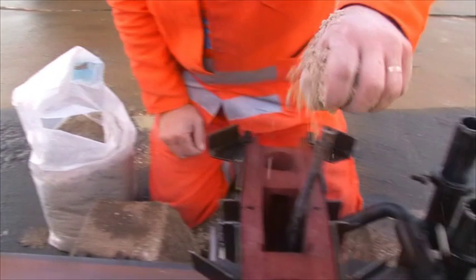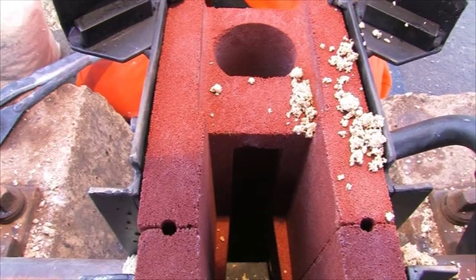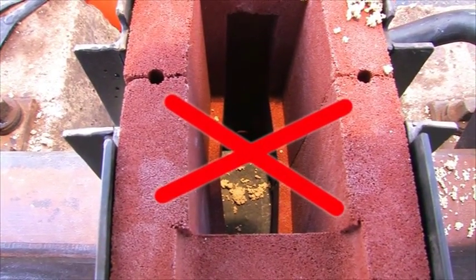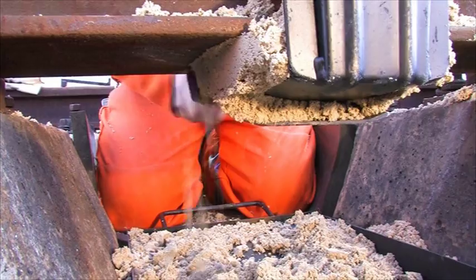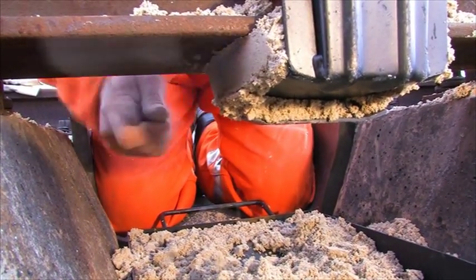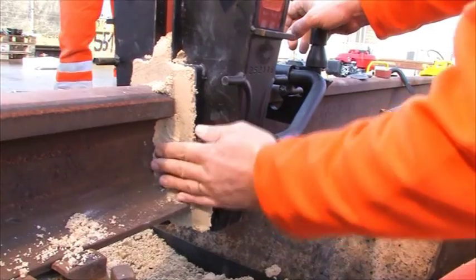Luting is to prevent any falling of sand into the moulds, as sand inclusions in the weld would be the result. Luting material is to fill up to the outer edge of the mould shoe, then to press on all around carefully to compact. Work accurately and don't forget any place, otherwise the liquid steel will leak out there later.